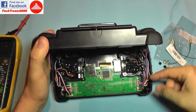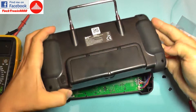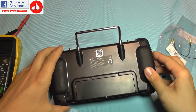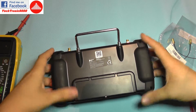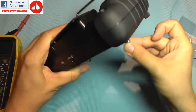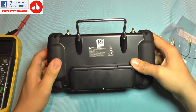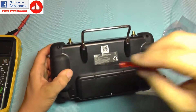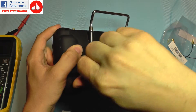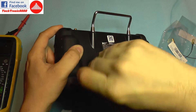Check that no other wire is sticking out on the side of the transmitter so it doesn't get crushed when you close it. Put it together as it should be, then move the switches on both sides to see if no wire has caught the levers inside. Mine is free of tangles.